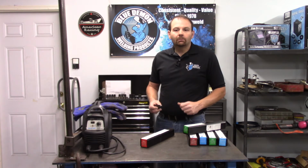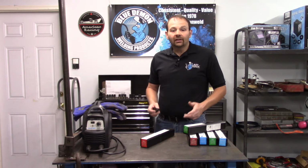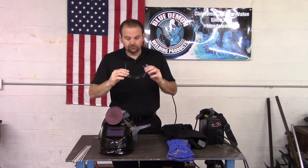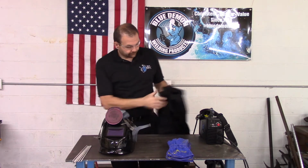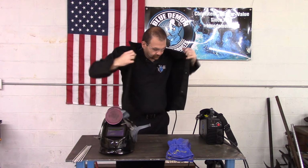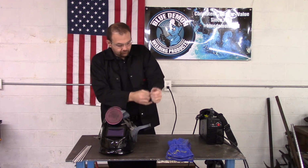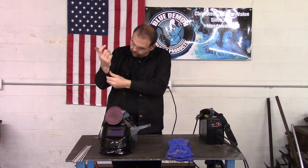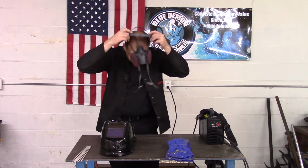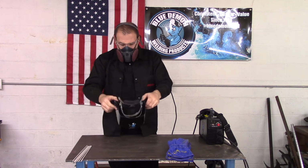Let's stop here for just a moment before I begin the demonstration portion. We need to talk about safety. The welding process can produce harmful light, fumes, sparks, and flying slag, just to name a few. You should always wear the proper clothing and safety gear while welding. This includes, but is certainly not limited to, a welding hood, welding jacket or long sleeve shirt, I would suggest cotton or wool, as synthetic materials may melt to your skin. Next, select the proper thickness of gloves, ear protection, and safety glasses. One should always wear eye protection during the welding process.